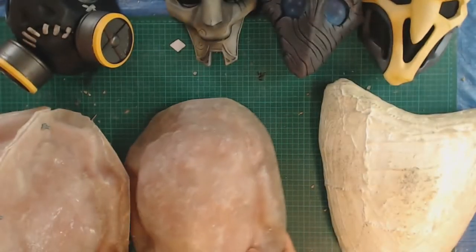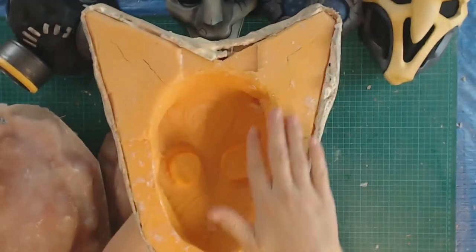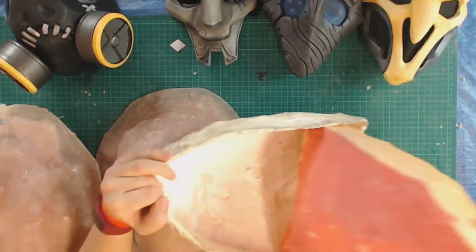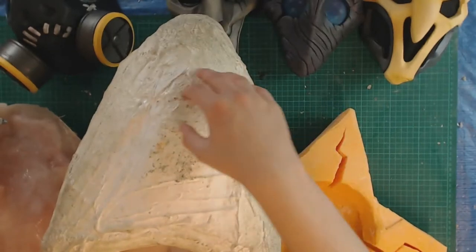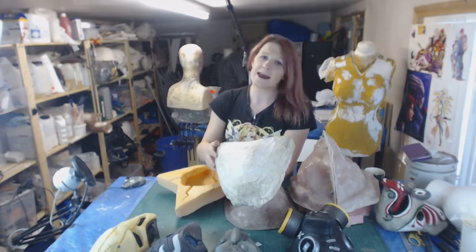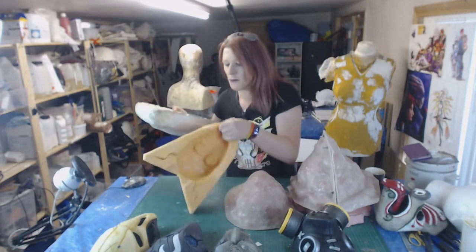There is also a much easier option, though it comes with drawbacks: using plaster bandages. We have our silicone — same silicone as in the other two moulds, just a different catalyst colour — and the plaster bandages go over it just as the fibreglass does. What I do is impregnate strips of hessian with plaster and go over it. The big difference is you only need about two layers of really thin polyester resin to get a fibreglass mother mould, whereas the plaster is a big wad of rock and makes the whole mould quite heavy.